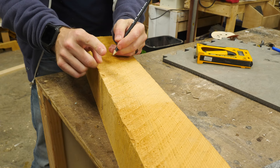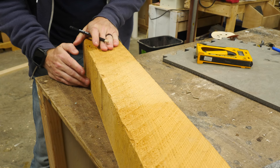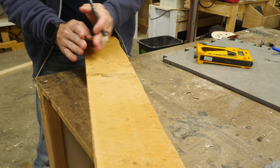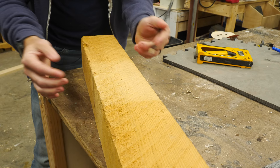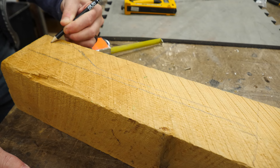I don't think I've ever made anything like this before but I have watched other people do it. So I'm going to cut this down so I've got some clean ends. Then on one face I'm going to draw out the general shape of the spoons that I want. After I cut that out on the bandsaw, I'll flip it over on its side and cut that piece into slices, giving me two or possibly three that are all basically the same shape. From there I'll go back with some different tools and shape them up to get them nice and smooth.